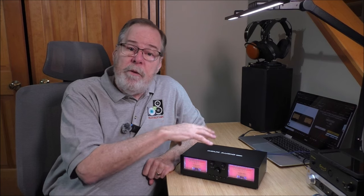As a device, one of the things I found interesting is it has a 5-amp large current relay in it. So let's say a speaker blows and you get a dead short — that dead short won't get past this to your amplifier, so it'll protect your amplifier. It also has load resistors built in. That's important because tube amplifiers, especially Class A tube amplifiers, absolutely hate it when they're turned on with no load connected to their speaker terminals. Once this is connected to the amplifier, even if there's no speaker connected, it presents the appropriate load so those tube amplifiers stay stable and happy. I thought that was kind of cool.